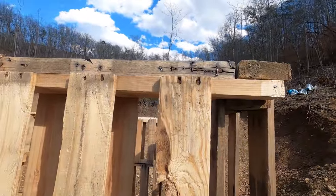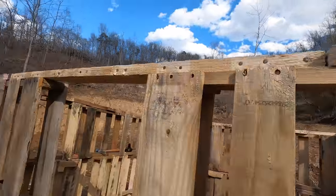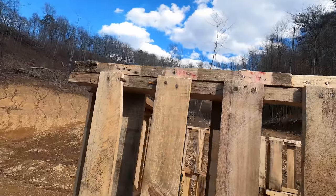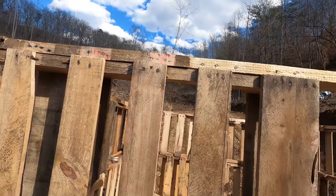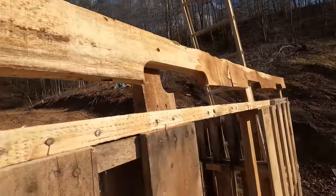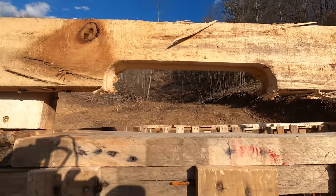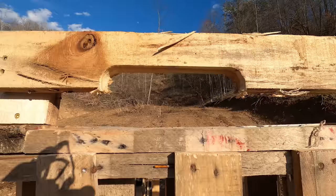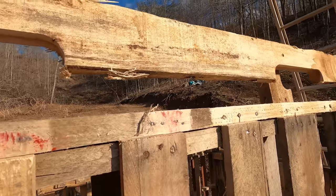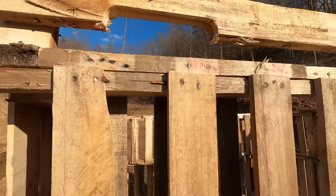I've got all four walls up. I took some stringers out of the pallets and went around and put one all the way around to tie in the walls and give it some added strength. Now I'm ready to start putting a roof on. I want the roof to have a little bit of pitch, so I took some stringers and built a header — raised up about six inches. This building is just six foot eight inches wide; I just want the rain and snow to be able to drain off so it doesn't hold a lot of weight.